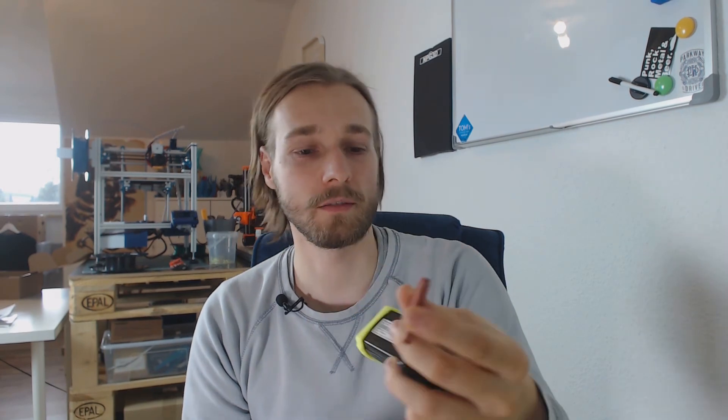I'll need to ask my friend which one he wants to use — this one or that one. If he wants the stiffer material, I'll print it in ABS so it will last almost forever, I hope. I call this practical 3D printing — you can use this skill on almost everything, just trace the outlines of the part and you're good to go. Use the tools in Fusion 360, do some iterations — you won't have the perfect match the first time, but that's the benefit of 3D printing. This took me about two hours to find the sweet spot where it holds perfectly.